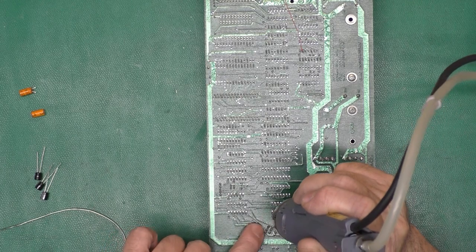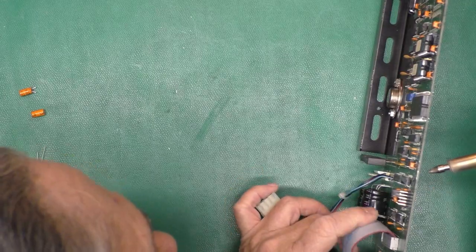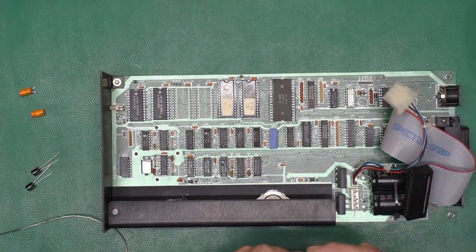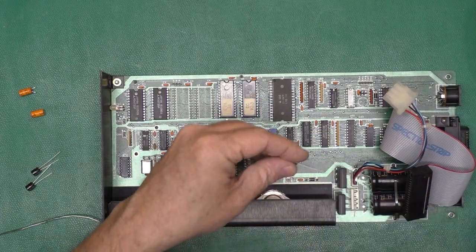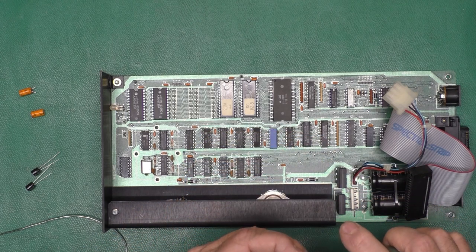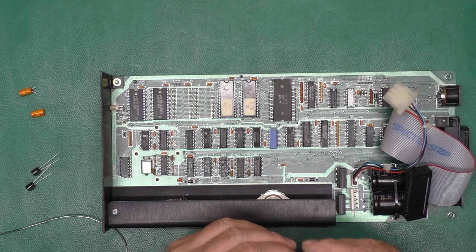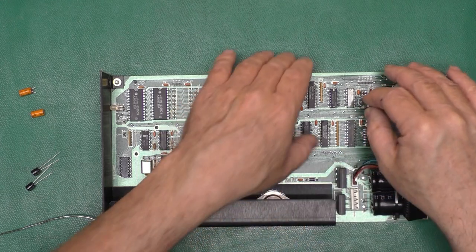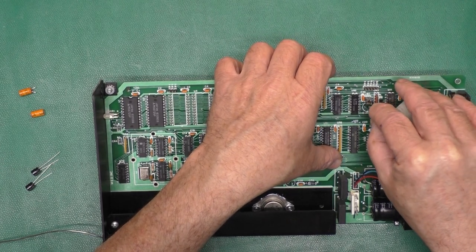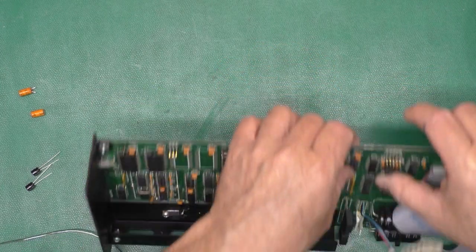And where was the one on this end? I forgot already. It was right here. I think we'll have to adjust our pin spacing a little here, or the lead spacing. These caps I had on hand are what I buy for Epson HX20s. Same value, just a little narrower lead pitch. But we can adjust it.